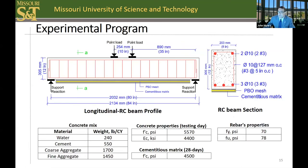Here are the details of the reinforced concrete member, as well as the mix design, the FRCM matrix, and rebar. It may be noted that the concrete mix properties were selected to be representative of concrete properties for older bridges that are candidates for strengthening in Missouri. In terms of compressive strength, this would represent a bridge built perhaps in the 1930s to 1950s.